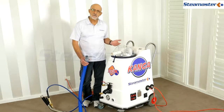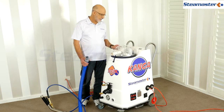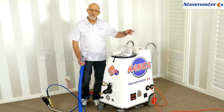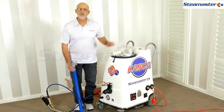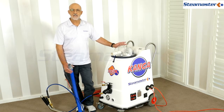If you overfill the machine, or the waste pump hasn't been pumping out enough, the water level will rise and get through to the ball valve. If that little ball valve doesn't shut it off properly, you'll end up with water actually spraying out where air should be coming out. If you see that, stop the machine quickly and empty that tank out.